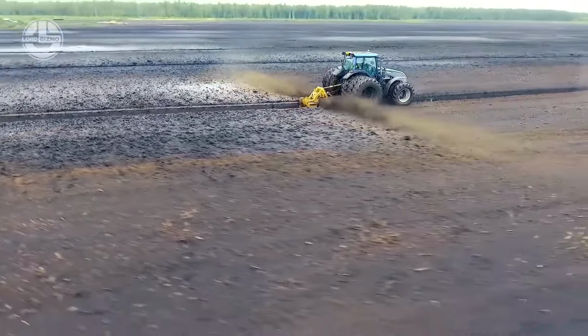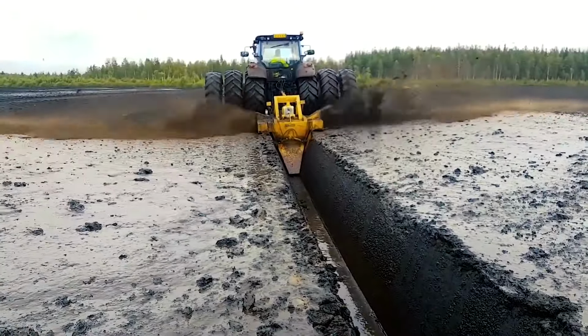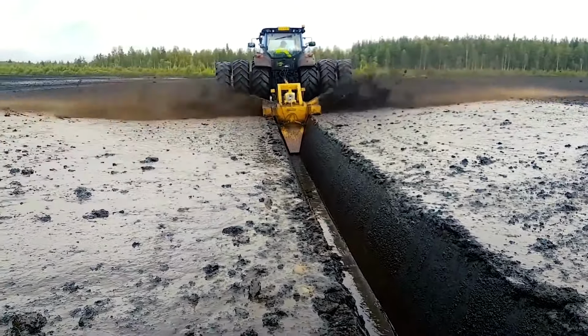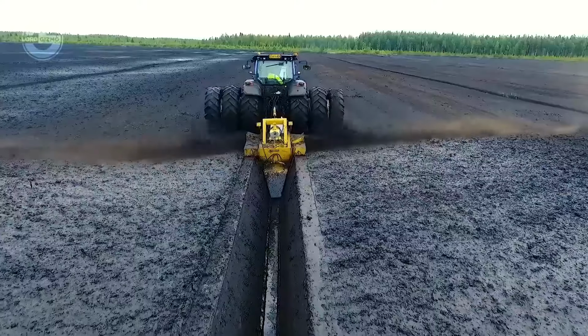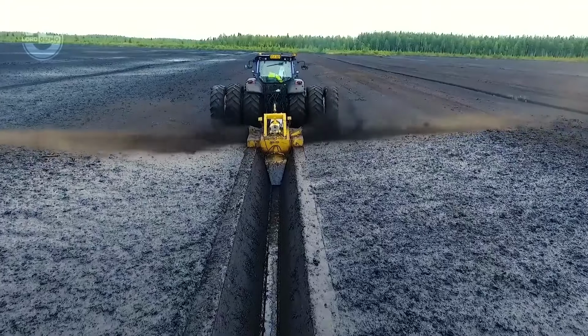Even during ground frost, screw ditchers and levelers are efficient instruments for ditching and sculpting peat strips. The use of screw levelers reduces maintenance work in the autumn by leveling raised ditch borders and spreading extra peat uniformly.